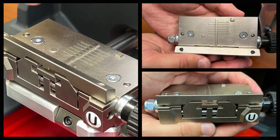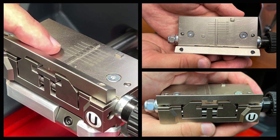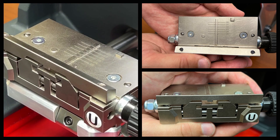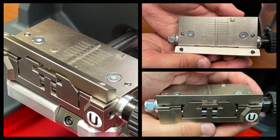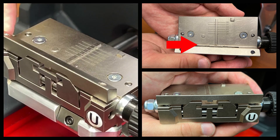The U-Jaw has six lines, U0 through U5. These lines are used to roughly gauge where the tip of the key should be inserted. The machine will read the tip position when it starts to decode and cut. There is a channel at the front of the jaw behind the clamp for the shoulder stop.